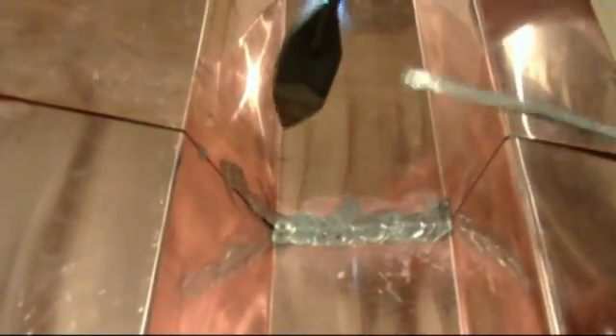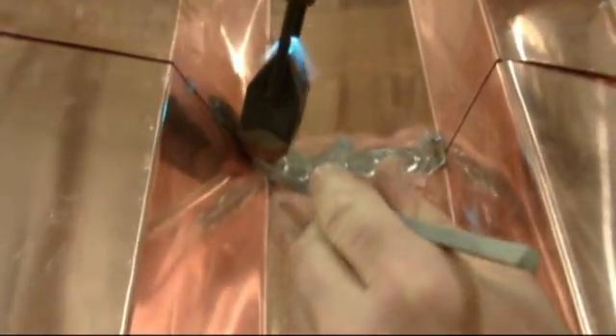We'll put some more flux in here and then start back at the bottom. Pay attention to your heat — if the solder starts running away too quickly, it's too hot. This is where the very sharp point comes into play. You want to make sure that you put the flat face against the upper part of the copper side. As you start soldering, touch the back side of the iron and it will ride down and drip and drag right across the front. Then you go up and out of what you've just soldered a little bit.